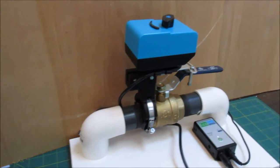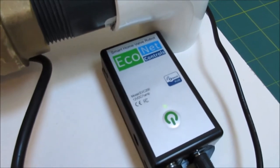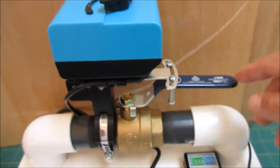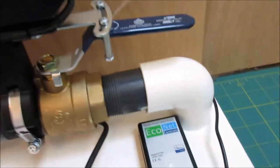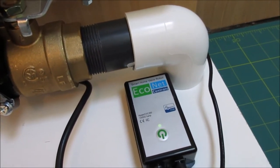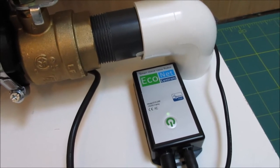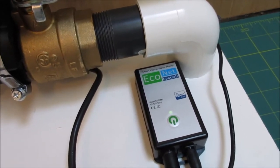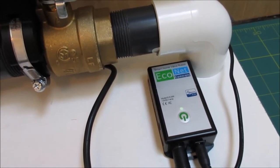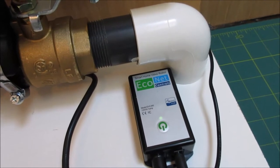The first thing I'm going to cover is the LED status. It's a bit hard to tell in this lighting, but right now that LED is on, meaning the valve is open and the device is paired. When the EVC 200 control module is not paired, it flashes — it blinks slowly when unpaired, and it still indicates open or closed by a long on or a long off as part of the blink. Right now it is already paired to my SmartThings.